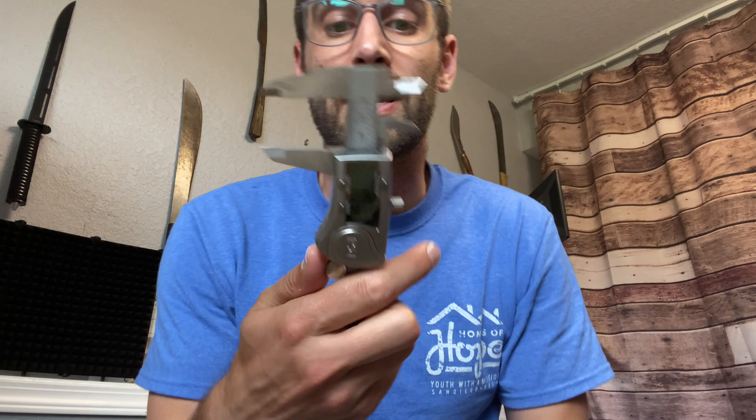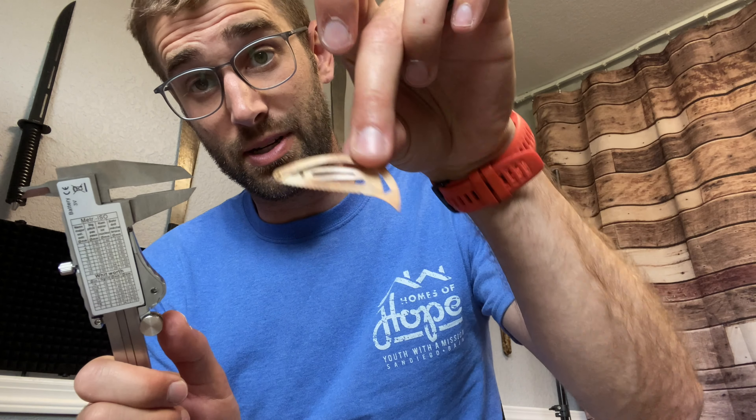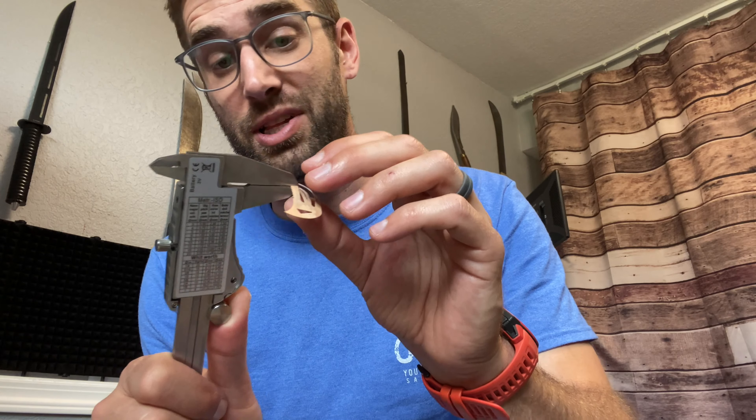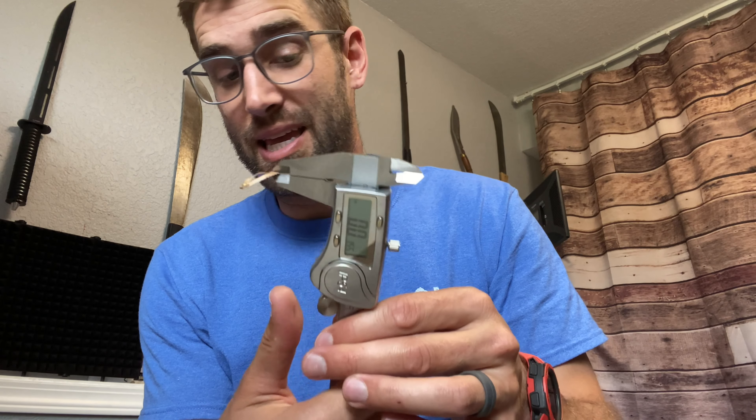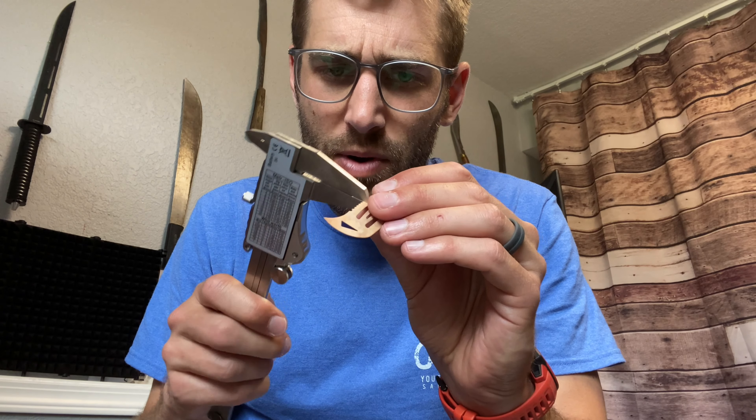The reason why I got this digital caliper is that I do a lot of factory type stuff and they needed to know — for example, my tactical hair clips that I get made overseas, they'd ask what thickness do you want? And I really couldn't measure anything with a tape measure or a ruler. So in this particular case, I would cycle it through to millimeters and say I want this thickness. With not too much pressure, this is 0.37 millimeters thick — that is how much my tactical hair clip is. I would give them that and say yes, this type of spring steel or stainless steel, I want that thickness.